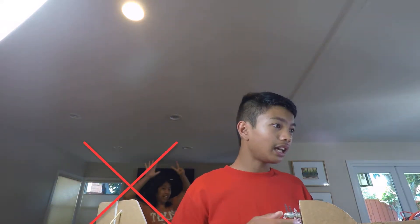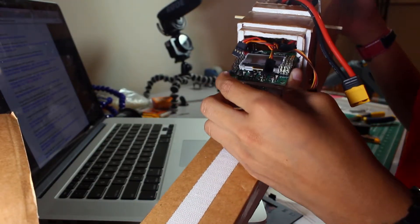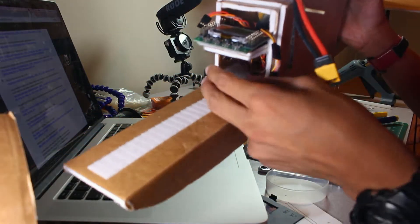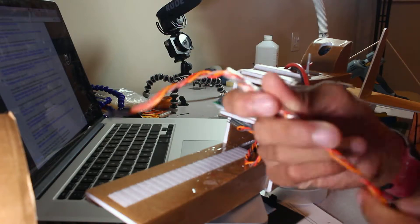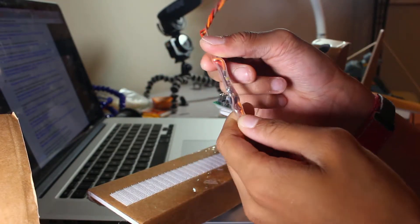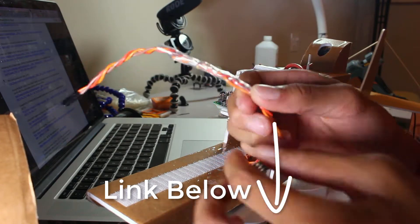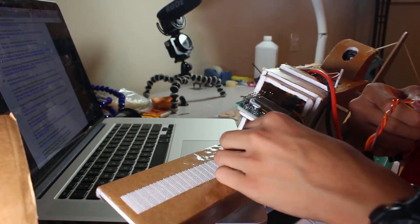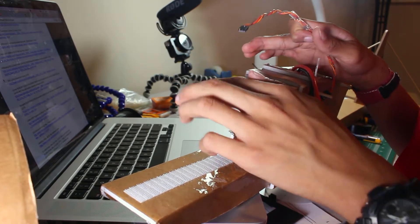And then you're going to need a KK2, which is this guy right over here. The KK2 board will be used as the flight controller. You'll also need an S-Bus connection cable, which I actually made my own. I'll show a link in the description to a tutorial I found online where you can make one of these. S-Bus is inverted for some reason, and you need to un-invert it so it can communicate with the KK2. You're going to need a USBasp AVR programming device for ATmega processors — I got mine off HobbyKing.